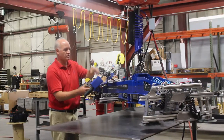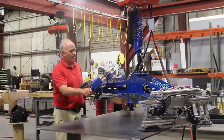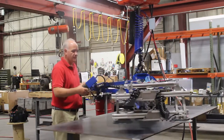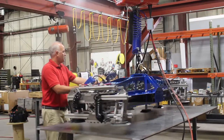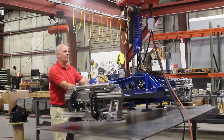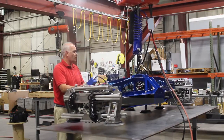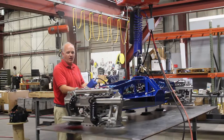We have three sets of pumps, that's why you'll see three separate indicators for safe lifting, so that gives the operator knowledge that it's safe to lift. It is on the CM Load Star, three-step input, and variable control, which gives you very good spotting control.